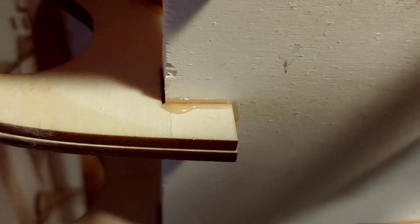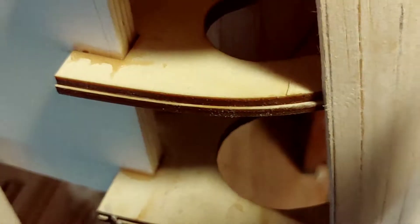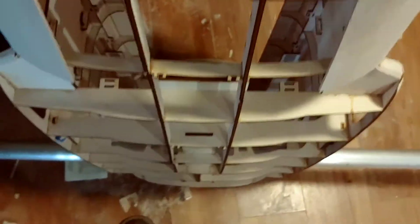This is the way it should look, guys — that's what your glue joint should look like. Once this is all trued up, this stuff will all fall into place and be just amazing. I did my joints like this, and these are just very easily trimmed off. This is the way they should be — just snap it off, take it off the jig, and it should be good to go.